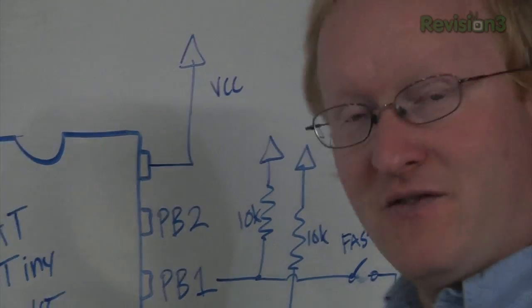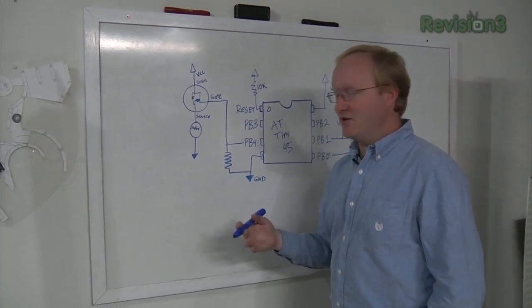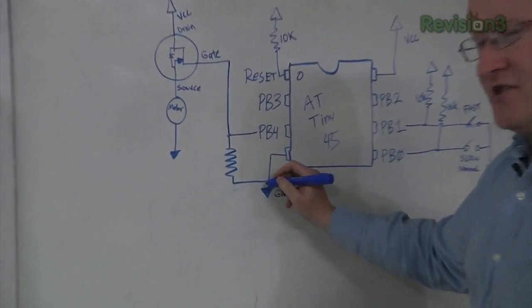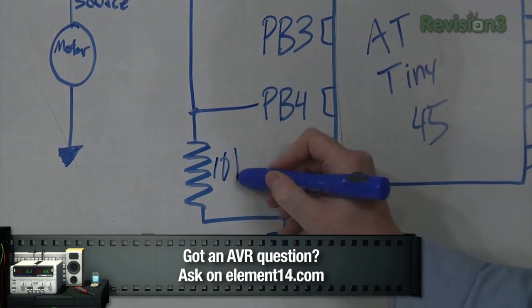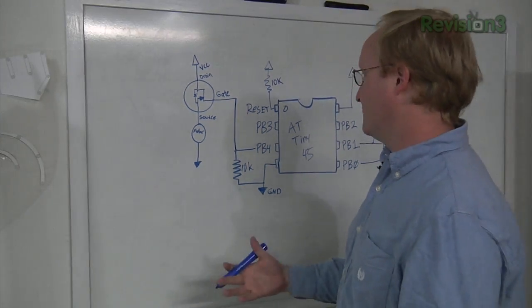And then the output signal that actually tells the motor to move, once a day about 12 degrees, we pulse this line here. We have a pull down resistor, which means if it's left floating, it will not trigger the MOSFET. It'll be a 0. It's always good to have pull downs and pull ups because you don't always know what state your lines are going to be in, so you ensure that they're in a certain state by using pull ups and pull downs.